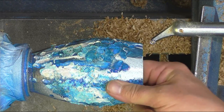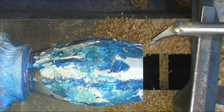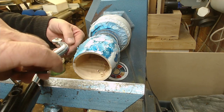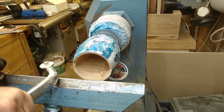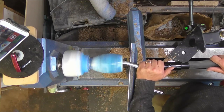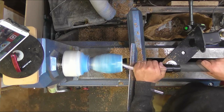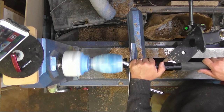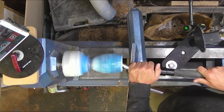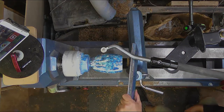The other thing to say about this tool, while we've got it in close-up, is that the arm that has the cutter tip on can be swivelled — from about 90 degrees from that point — so you can get a very good cut through a smaller opening. Again a 19mm bar tool, but this has got a 12mm high speed steel scraper tip on, and that's doing a good job of blending whatever little ridges there might be from the smaller diameter cutter on the inside. The heads are interchangeable though — you can fit the cutter tip on this if you wanted a smaller opening and angle your cutter tip a bit more.